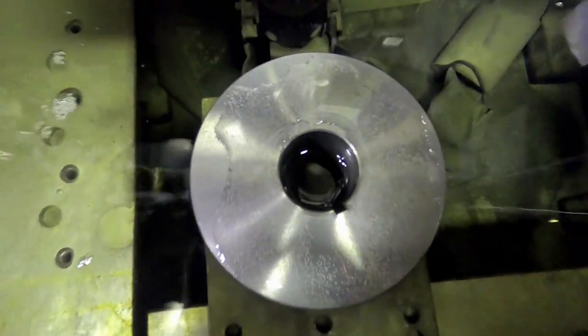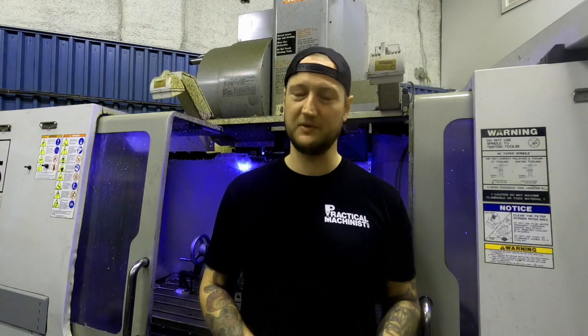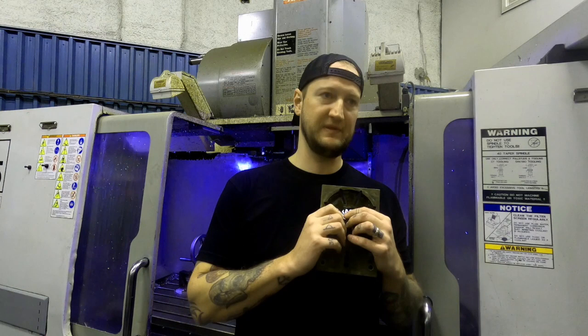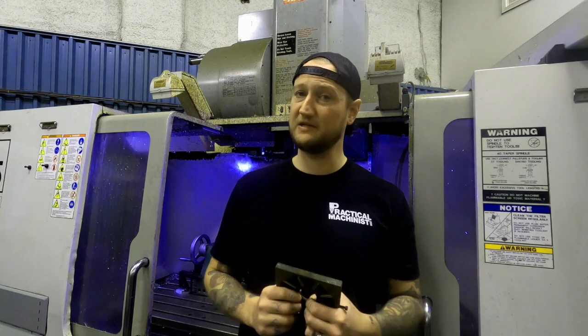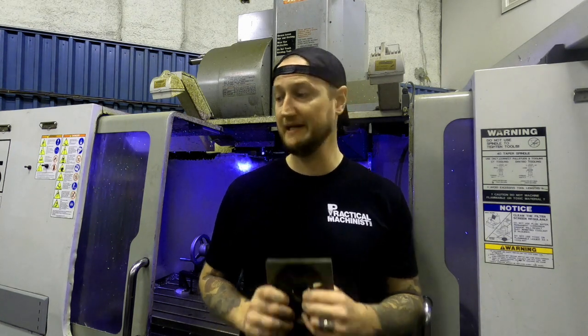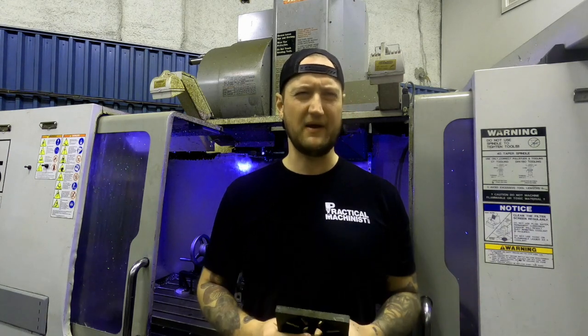Most importantly, guys, with wire EDM you have your roll of wire as a consumable, not to mention the resin in the tank, not to mention the filters, not to mention the contact plates. There's a lot of consumable items on a wire machine. Wire is just one of them. A roll of wire, the size we get, costs around 110 to 120 bucks.